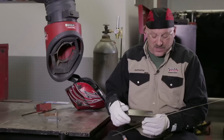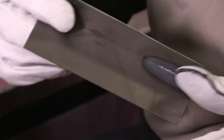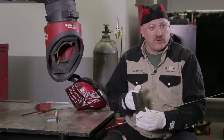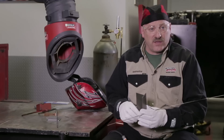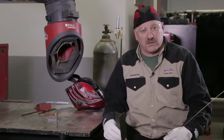If you use a pulser, keep your current down low, sometimes if you're real careful you can avoid that altogether, but sometimes it's difficult to avoid the burn through on the back side. And if I want to weld a back on a fender for a car, something real thin, and I don't want this damage on the other side, sometimes brazing's the answer, and you can TIG braze. You can't use regular brazing rod because it has a lot of zinc in it, but the silicon bronze will work.